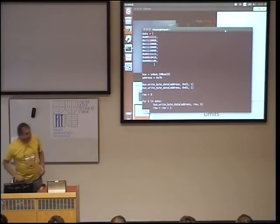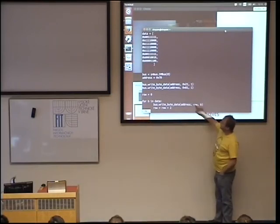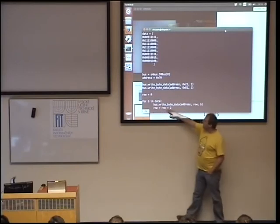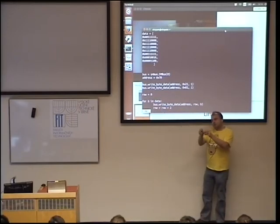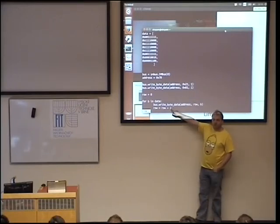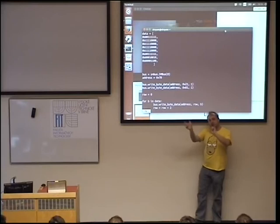And here I am writing, so every row has an address, I'm starting from address 0 because there is a chip which can control bigger displays. I skip every second row in the memory because for this display I need to write only every second row of the display, because the rest is for bigger displays.